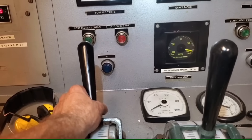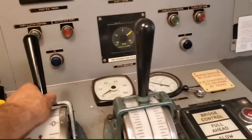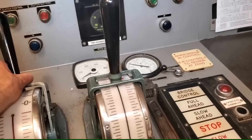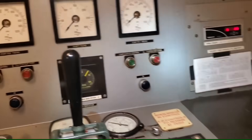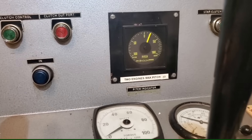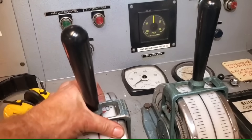Quite an interesting experience — that certainly got my heart started. Here you can see the pitch indicator moving from zero into the positive, going ahead. The camera angle is perfect — you can see the pitch indicator. Now it's coming back — ahead is the better terminology — going back to zero, which would not push any water, and then it'll head into astern. I've tested ahead up to 100% pitch — we usually only go to 75% — but you always want to test it, and now I'm testing astern.